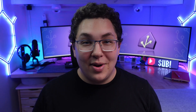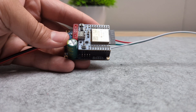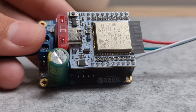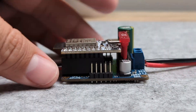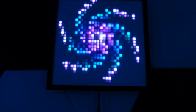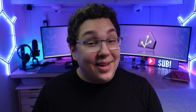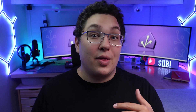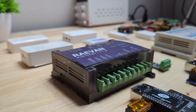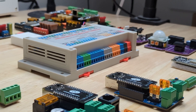The best DIY-style controller in my opinion is the QuinLED Dig Uno. You can get an optional temperature sensor to add to it and there are six GPIO pins available for additional sensors and whatever you want to do with it. If you're running a medium-sized pixel matrix like a 64 by 64, this may be the way to go because it has an ESP32 so you could run sound-reactive with a 64 by 64 without any issues. However I'm going to cover better options for pixel matrices in the next video.